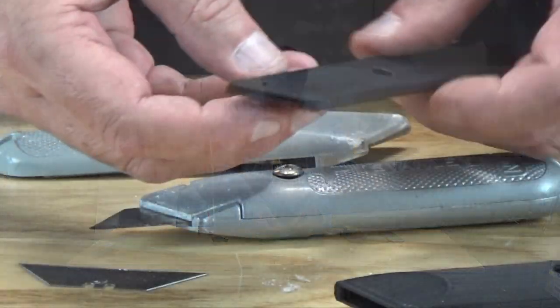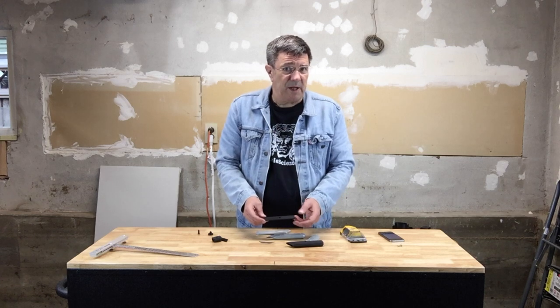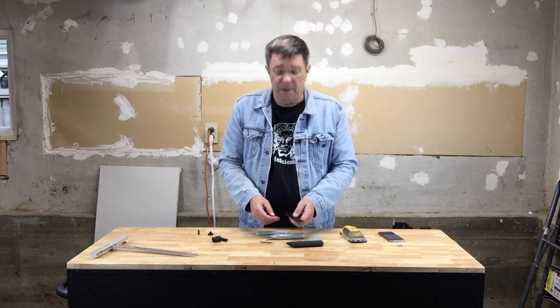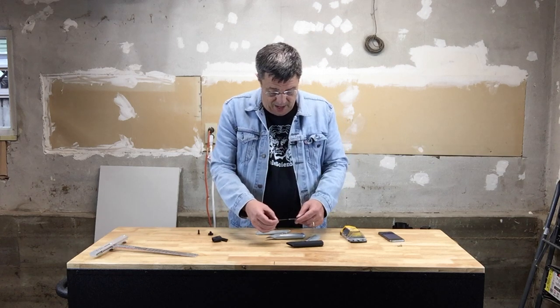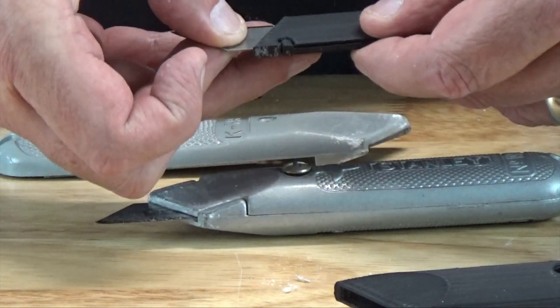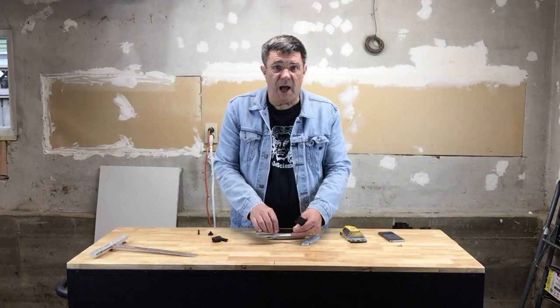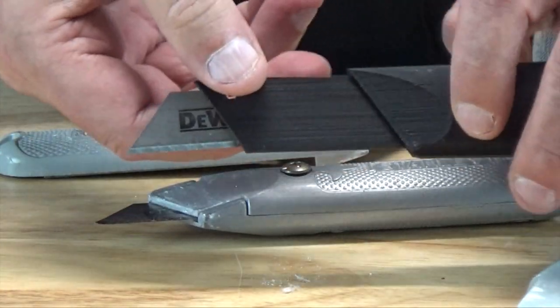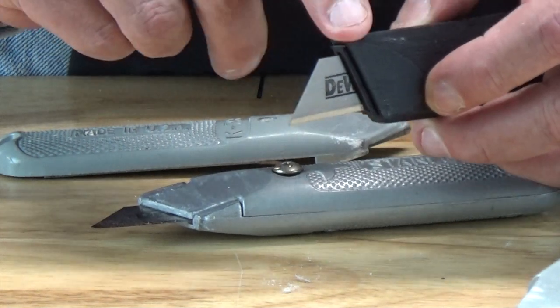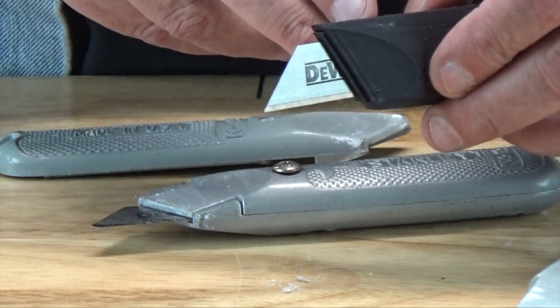What makes this work is a small, thin flap positioned at the end of a long tongue of extruded filament. Because the tongue is so thin, it retains its flexibility even when printed in hard filaments like PLA and ABS. There isn't much strength in this flap, but there doesn't need to be. In actual use, you take a blade and carefully slide it into the cartridge while gently holding back the flap. When the blade is in position, you let the flap fall into the notch of the blade. When you slide the blade into the handle, the walls of the handle hold the flap notch securely in place within the structure, and that supplies all the strength you need to keep the blade in place without damage to the notch.